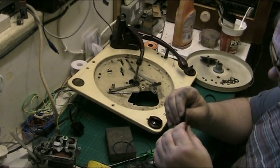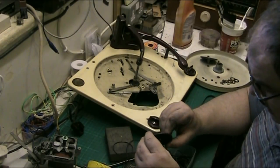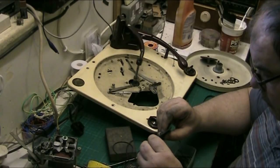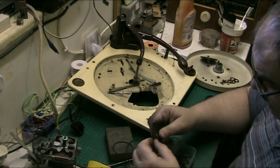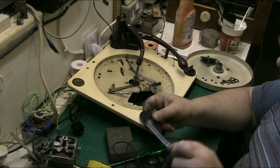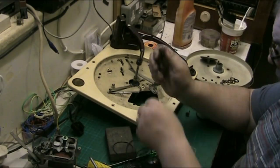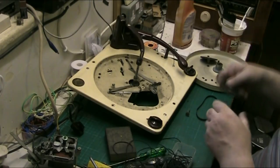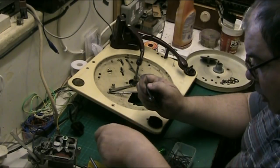What I'm going to do is put a groove in here all the way around with the Dremel. I'm going to carve a very shallow groove all the way around this rubber, all the way around this iron, because that's as hard as nails. That would never grip. Look, it would never work. So basically, I've got to do it this way anyway. I've not really got much choice.